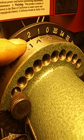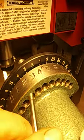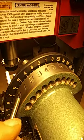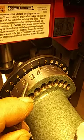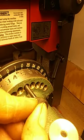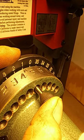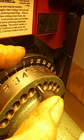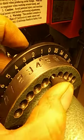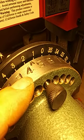Now, if I need to turn it another 5 degrees to cut another tooth, which I do on this particular gear, you take this pin out and you put it, each of these numbers embossed in the metal represents 1 degree. So 0 to 1 is 1 degree, 1 to 2 is another degree, 2 to 3 is another degree. So to go 5 degrees, I put it in the 5 hole. And then while I put pressure on this pin with my thumb, I advance the wheel some more. And notice that when it got halfway between the 1 and the 2, the pin popped in. That means it popped in at 5 degrees.